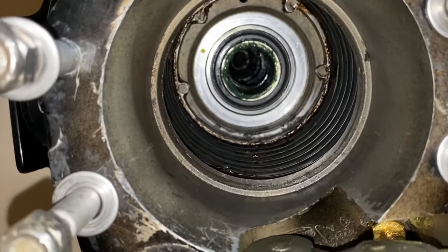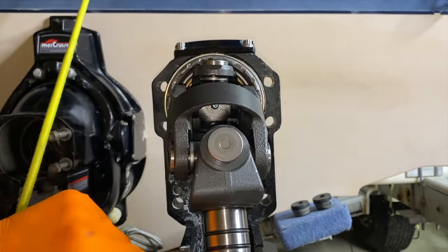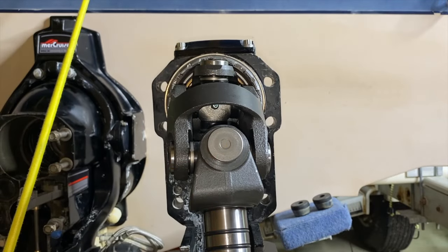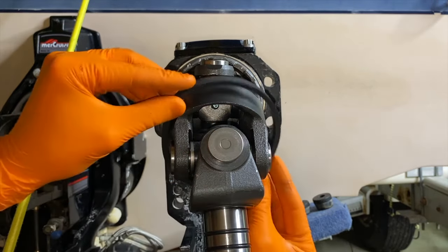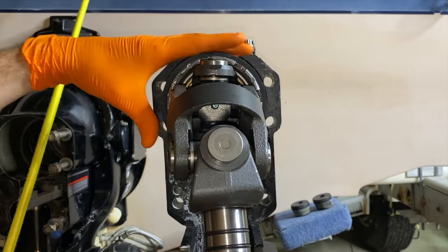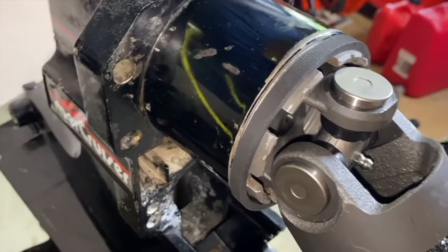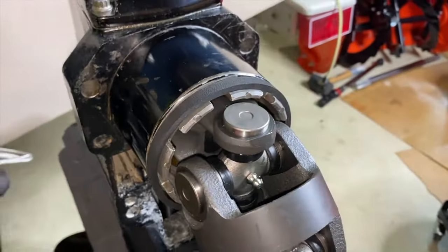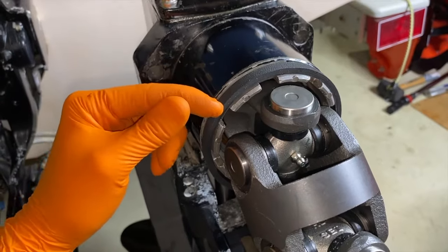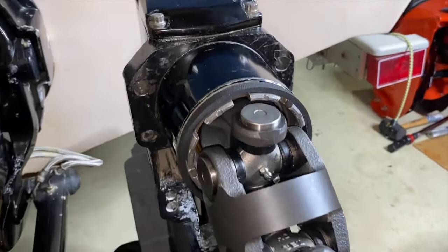We are now looking at the upper unit of the out drive with the universal joints and yoke shaft. Here are the two O-rings on the yoke shaft itself. I'm going to grab that large rubber O-ring and shift it up and around the U-joint assembly, and it will rest flush on the retainer nut. This is going to prevent water from sneaking inside and making contact with the U-joints inside the bellows — that would destroy them.